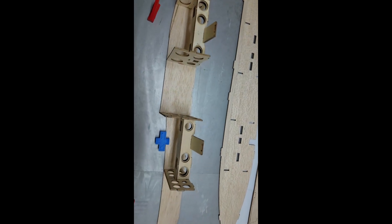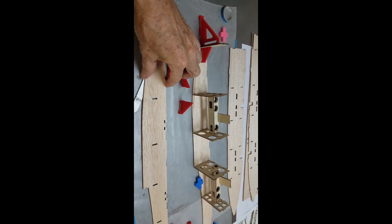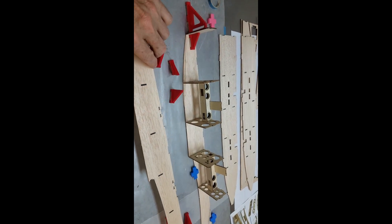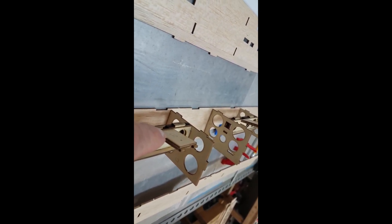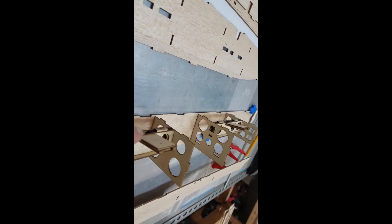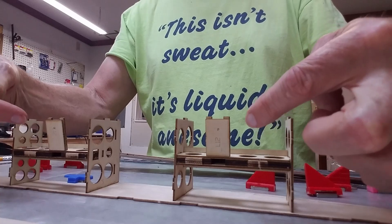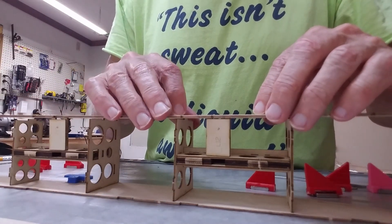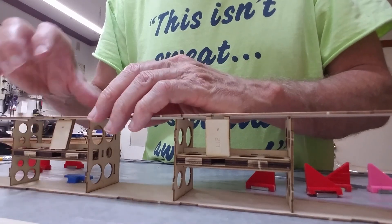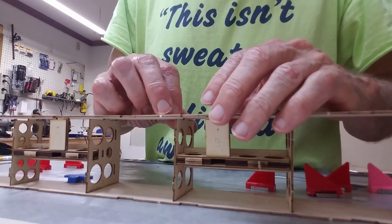You can see I've got my laminated pieces set within the formers. Now I'm going to be putting the top on, but I need to pre-drill these before everything gets sealed up and glued in. We need to make sure we're putting those pre-drilled holes in the right spot. I've already gone through the process of marking — let me show you real quick how I went about doing that. So first what I did was seat this side here and take a moment to make sure everything lines up. You've got to get all the tabs lined up.